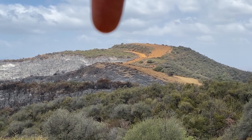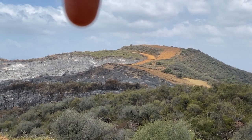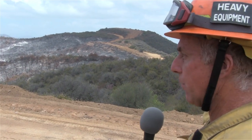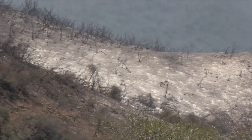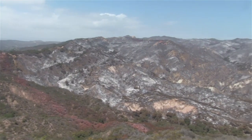Keeping in mind that as the rain hopefully comes in this year, the water's going to come down. It has to cast one direction or the other, otherwise you have big ruts that are formed in the ridge tops. So what we try to do, under the direction of environmentalists, is put in different water bars to cast water off.